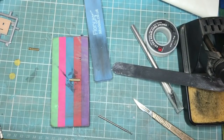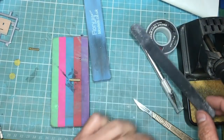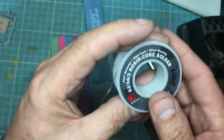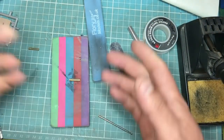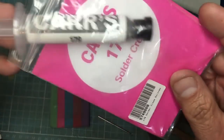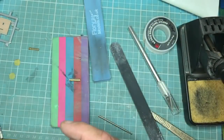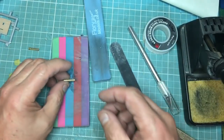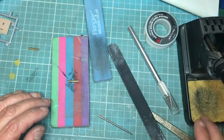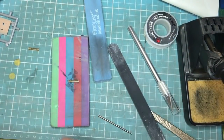Thanks for watching — if you like this please subscribe. I've got lots of little things like this that I do. I don't particularly like to start shouting that you need to buy this or that. What you do need is a decent solder and iron, and some of this lovely solder which I find amazing for photo-etched brass — just a few simple tools. Don't be tempted with solder cream — you never seem to get a really nice joint like you do with ordinary solder. Get some decent solder, a half-decent soldering iron, and a bit of practice — you can't go wrong.